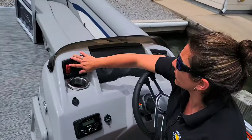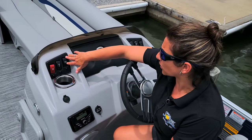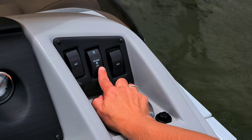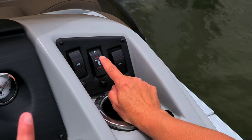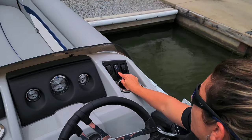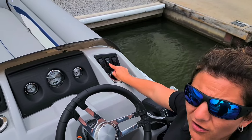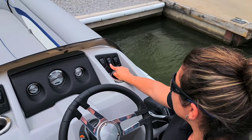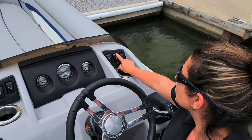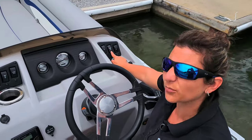At the helm you have a horn right here, and then docking lights and livewell — unless you're out for a week, you don't need to worry about those. The navigation and anchor light is a double rocker switch: forward activates your front red and green bow lights and the stern light on top of the bimini, for boating from dusk to dawn. Middle is off — make sure it's in the off position when not in use so you don't run the battery down. Down is just your stern light, for when you're anchored at night. I recommend keeping both the bow lights and stern light on so other boaters can see you more easily.